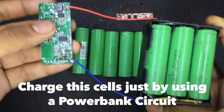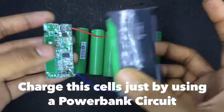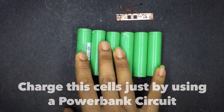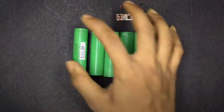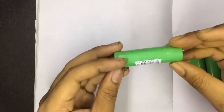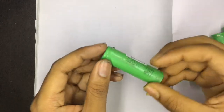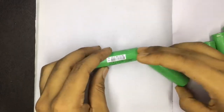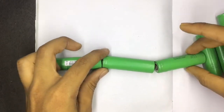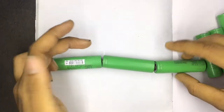First things first, you have to charge these cells, and I use this kind of setup. Make sure that the cells are at the same voltage, and let's see how to get 12 volt from these batteries. Each cell has 4.2 volt at full charge and a nominal of 3.7 volt. So as you can calculate, you need 3 cells in series like this to get 12 volt,